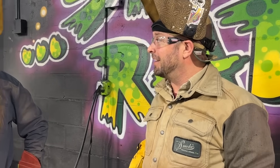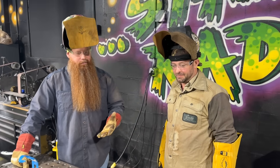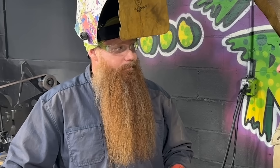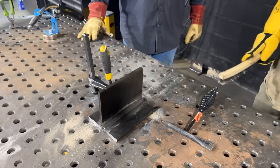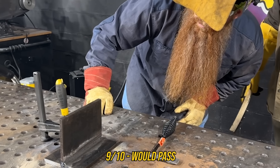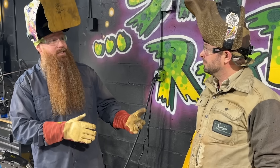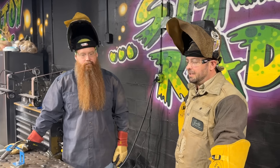It runs clean — dealing with a true spray transfer. Some advantages: good deep penetration. Some disadvantages: a little bit of cleanup taking the slag off, but we don't have to deal with any spatter. The weld scores nine out of ten — not bad for a first pass on gas-shielded flux core ever. It's super simple to run and easy to teach. I've actually certified a lot of different companies and convinced them to switch over to this process versus fighting every battle with short circuit MIG — now they've got another tool in their arsenal.